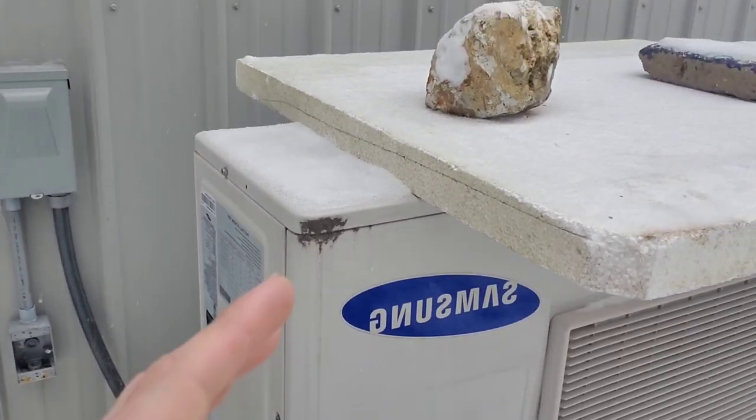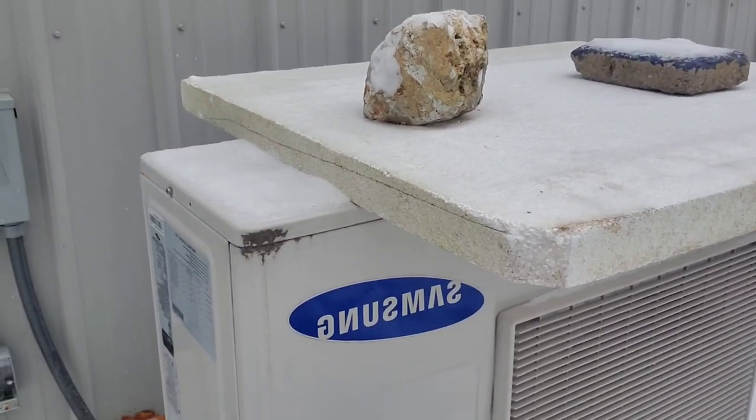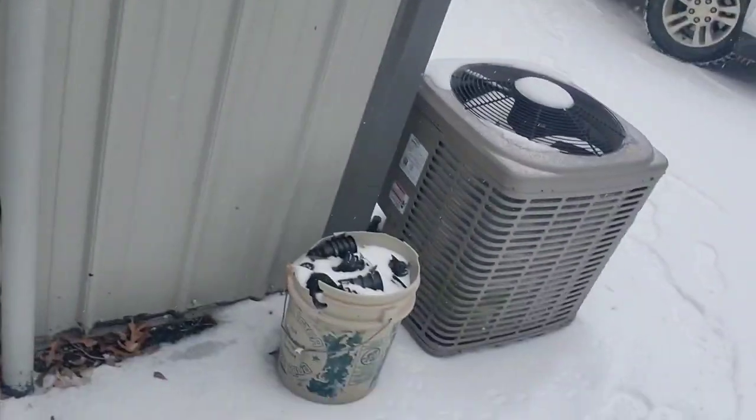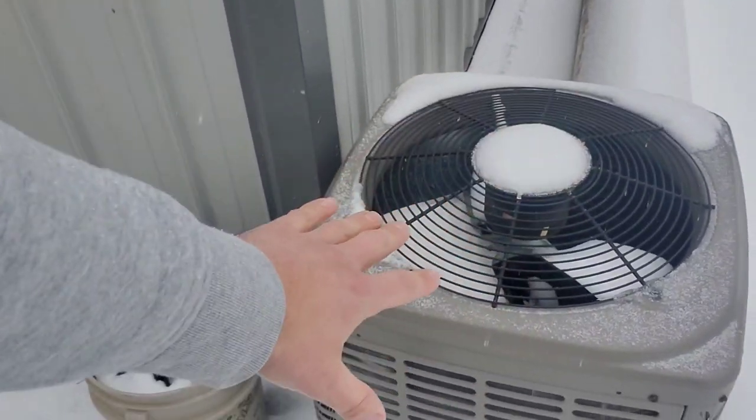This is VRF technology — I don't have heat strips. If you have a regular conventional heat pump, you have to use your heat strips, your emergency heat, when you have a situation where it's 10 degrees outside. Because below 30 degrees, you have to hit a balance point — that's where the load of your structure exceeds the capacity of the equipment. These heat pumps basically make themselves colder than the outside air, and when you make yourself colder than 32 degrees, you're automatically going to freeze up.